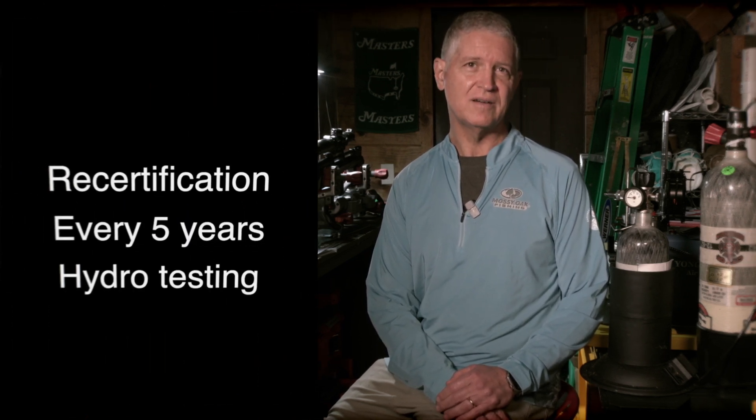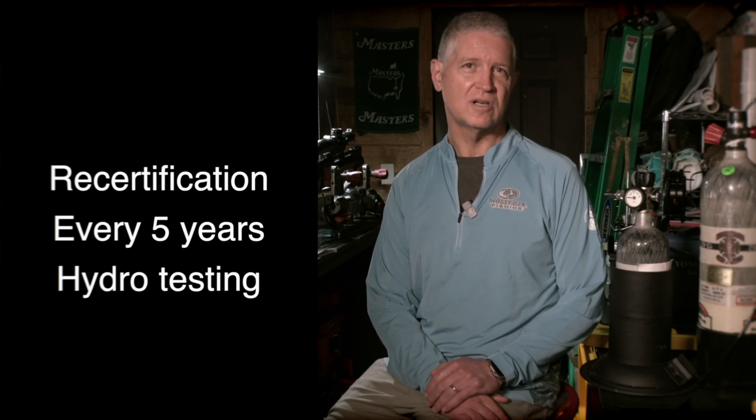Something very important to understand with any carbon fiber tank is that it has a 15-year lifetime in most cases. Whatever the cost, divide by 15 — that's ultimately your price per year. When you buy a tank, knowing it has a 15-year lifetime, it also has other requirements: every five years it has to be recertified through hydro testing. You would take or mail your tank to a place that does hydro testing to be recertified for an additional five years, until the 15-year lifetime is reached. Every tank will have a label showing its born-on date, and from that date you have a 15-year lifetime — or with aggressive recertification, up to 30 years with an SCBA tank.